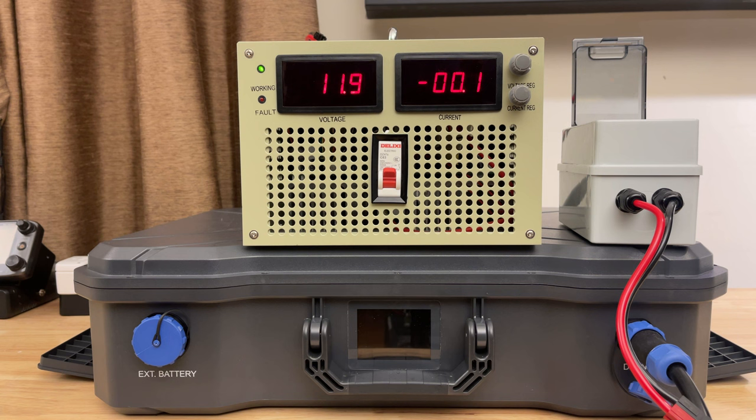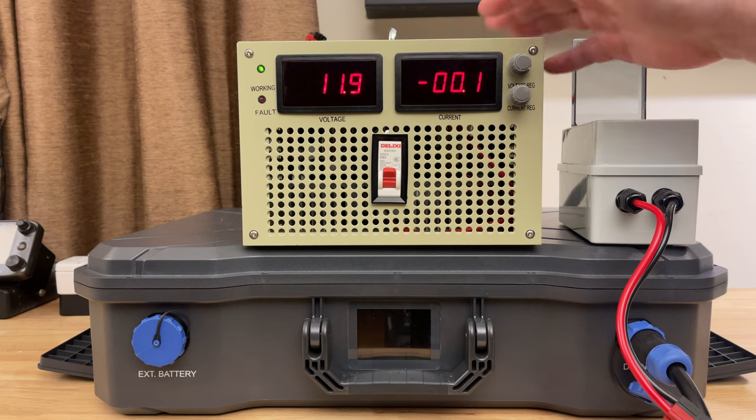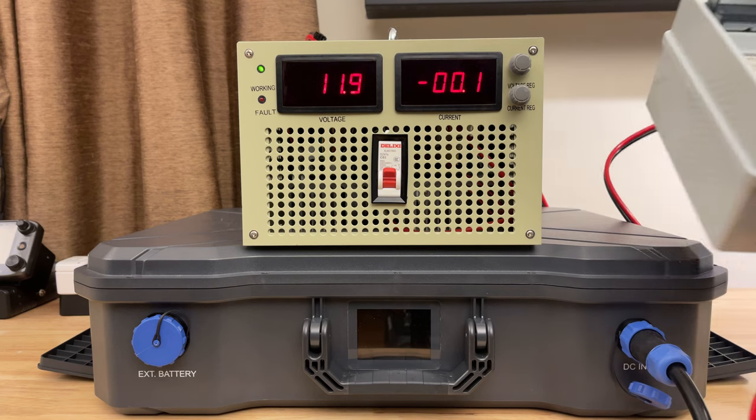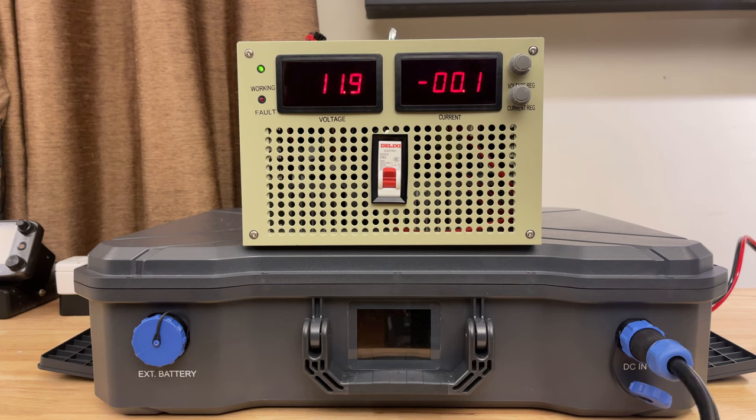Solar charging test. To see how fast the X1200 pulls power at various voltages, I'm using my 1V-150V at 33 amps (5000W) DC power supply feeding into a DC circuit breaker, then into the solar input cable. We start with the Montech turned off to confirm it auto-starts when solar power is applied — like when the sun comes up if you've left it connected to panels overnight. And it does: the unit turns on automatically when solar power arrives.